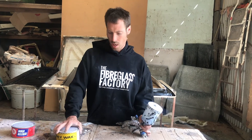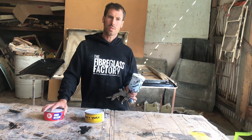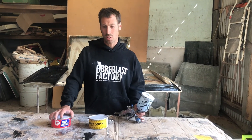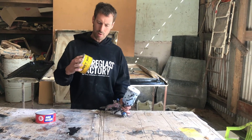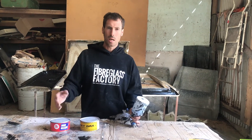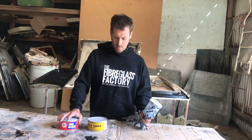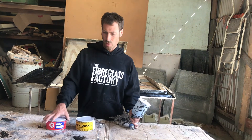If we're copying off something that's a really nice high gloss finish, then we can either use a TR wax and a little bit of PVA so that'll keep the finish relatively good, or we can do the semi-permanents which produce an amazing result, just costs a lot more. When a tin of Honey Wax and TR's about $30, for a litre of semi-permanents you're looking at $120. PVA's reasonably cheap as well, but this is sort of your cheaper option.